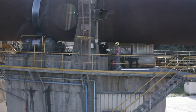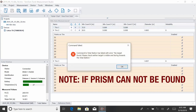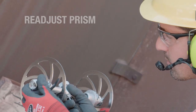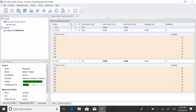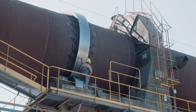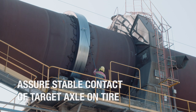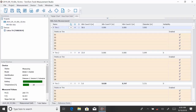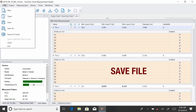Measure the remaining tire — here, tire one. In case a prism cannot be measured, perhaps because it is not visible or not sufficiently adjusted towards the theodolite, an error message will appear. Adjust the position or orientation and measure again. Note: there are no specific areas on the tire where the target axle needs to be placed, but it is essential that both wheels have stable contact with the tire surface while the theodolite is measuring. Now all tires are measured from the first station. Save the file.